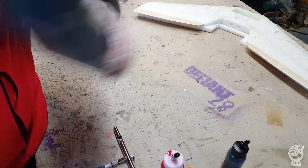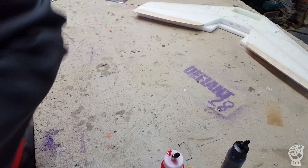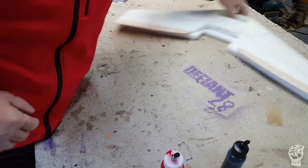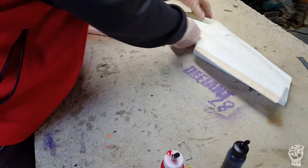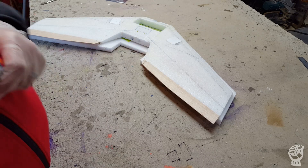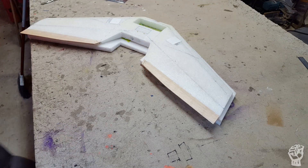It's kind of chilly in here and this pump has some tight clearances, so it's got to warm up. I usually just pull the hose off and let it run for a little while, then keep putting the gun back on until it runs completely. This is completely dry now with the 3M 90 on here — no tack at all. Once it's painted and we hit it with some laminate and a hot iron, those layers of paint, 3M 90, and laminate adhesive will all fuse into a really strong bonded layer.